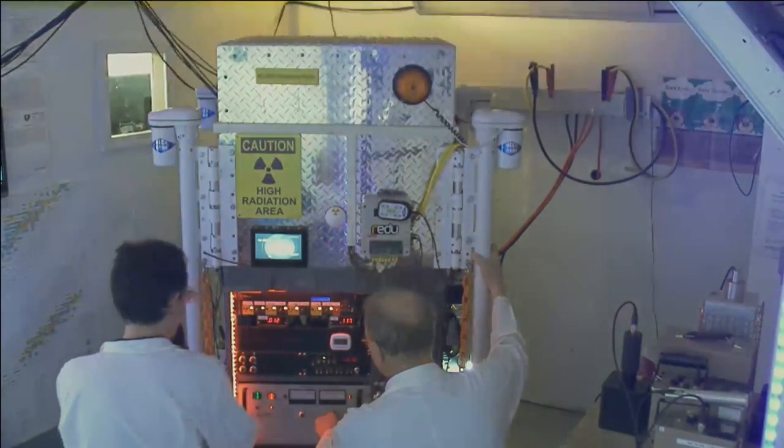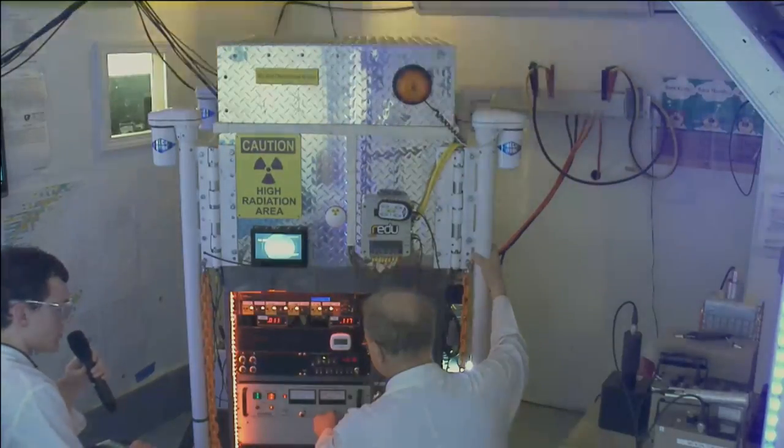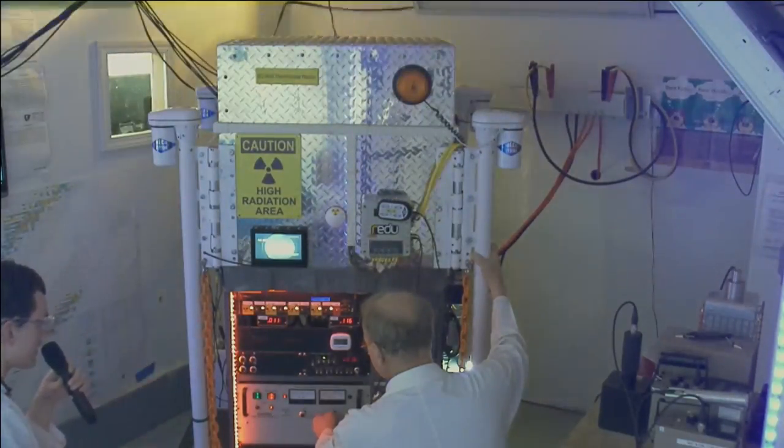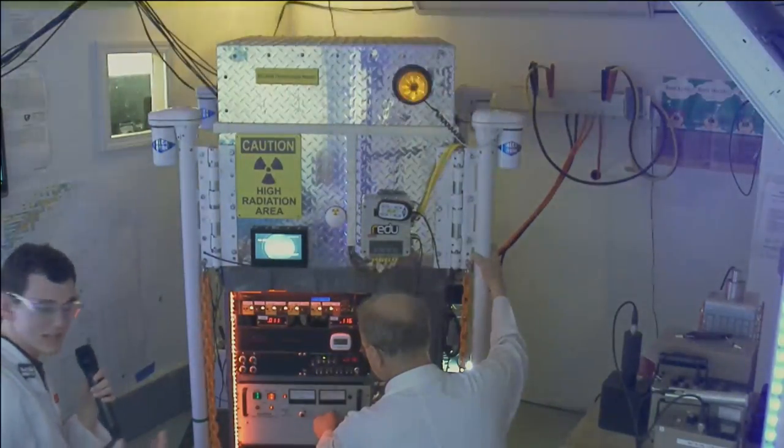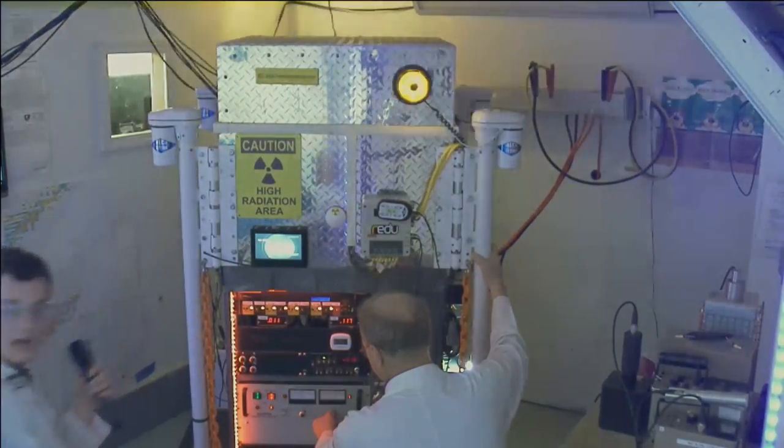The reactor can be a bit fun on startup. You got to balance a whole bunch of things, make sure that you're staying right around 5 milliamps, reactor has to outgas, just a whole lot of stuff. But that's a system like this. I mean, that's every highly technical system.